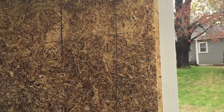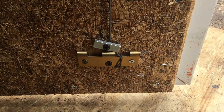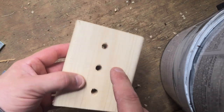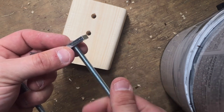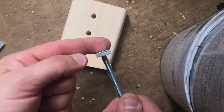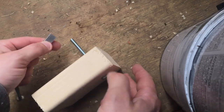Here's what the door looks like now — it's warping towards the outside. So in order to fix that, I made this contraption. I took some heavy gauge metal wire and stretched it from the top to the bottom, and I used hinges to hold it in place, and a couple extra metal brackets here. And I took a scrap 2x4 block that I had and drilled two holes in it. And I'm going to use these bolts — these are actually made to hold countertops together. So you have this little bar here with threads on it. And I'm going to take this block and put these through.